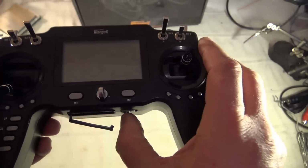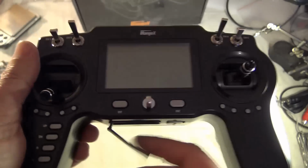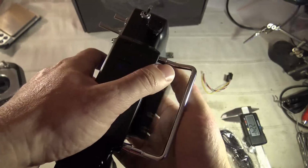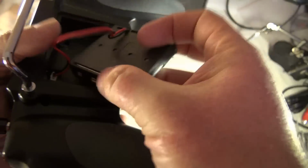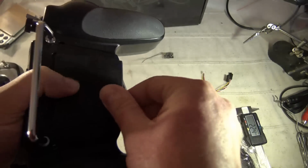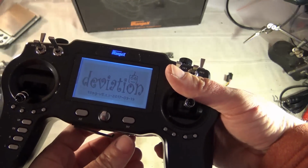And now, when we turn on the radio, nothing happens. So there is a bug. Okay, sometimes when you enter into the USB or DFU mode, this radio refuses to boot. How to proceed? You have to wait some seconds or disconnect the USB and the power button, and reconnect it. So there is a kind of problem with a small cap somewhere that makes it refuse to boot. Sometimes it's a little bit annoying, but as soon as I do this trick, okay, I will be able to return to my radio, no problem. Look, that is turning on again.